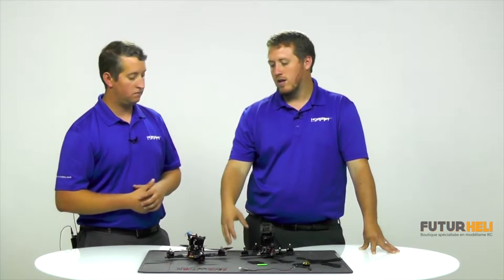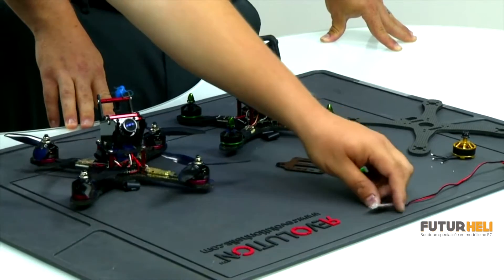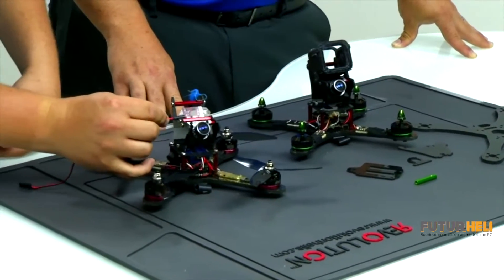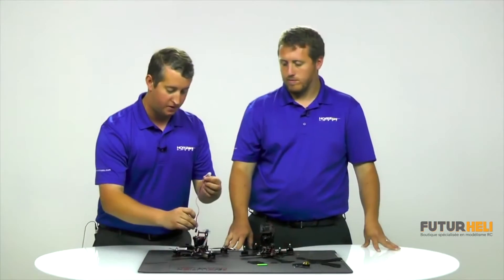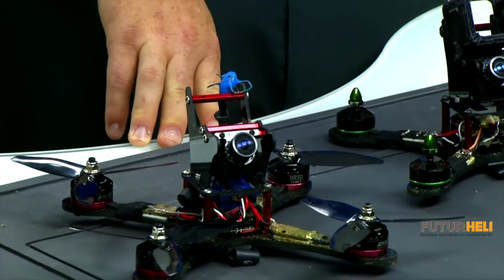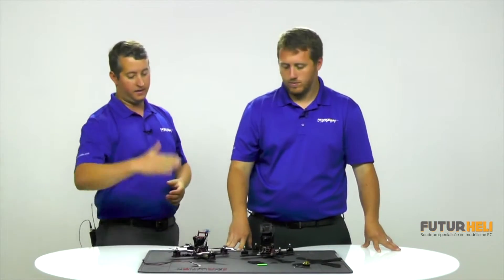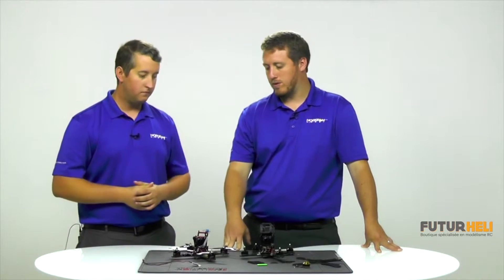If you're running the shorter style antennas like the IB Crazies or the Tri-Humps, it's well protected, especially with the GoPro mount. One thing I found last weekend racing in Phoenix is that without the camera, it's actually a perfect perch for the transponder on top of the quad. I just have a female servo lead in there, plug my transponder into that, and electrical tape it — it carried it perfectly. A lot of times small frames are so hard to get a transponder on for racing, but those little ears really help in just mounting everything else.